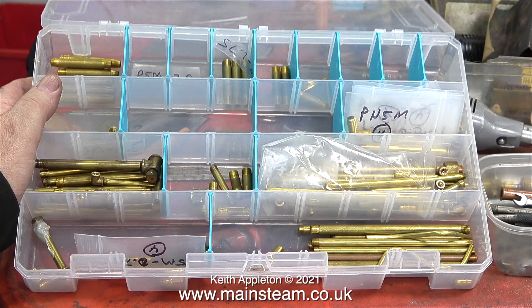The internal bore of the piping is only just the right size to exhaust the engine efficiently. A steam engine is a gas engine — the white stuff that comes out of chimneys and exhaust pipes is not steam, it's water vapour. Real steam is an invisible gas and when it's superheated it's very nasty stuff. All of the piping needs to be of a sufficient diameter to supply and exhaust enough steam without any bottlenecks occurring.